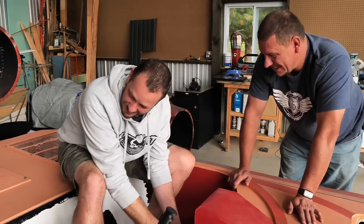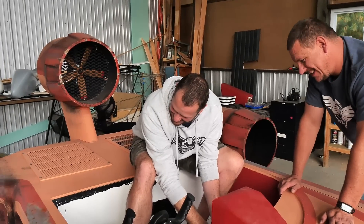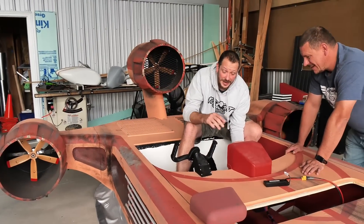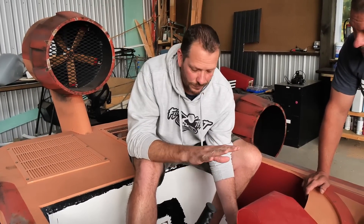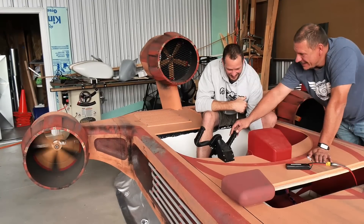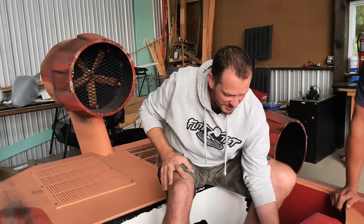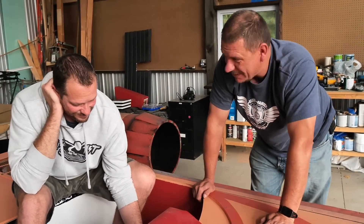You ready to try the throttle? I decided to add a little bit of safety so it doesn't eat our heads — I added a grid on that thing. One last little test here. I went ahead and did a mix that ties our aileron to our rudder, because this is actually differential off the rudder. You'll notice that the back prop only spins with throttle — it's not tied to any steering inputs, which is what we want. That is awesome. We'll get that glue in place, put the interior together, and give it a shot.